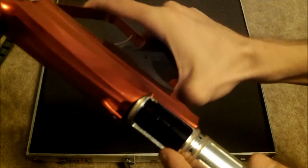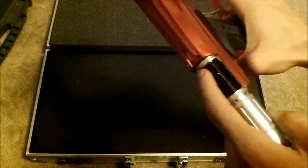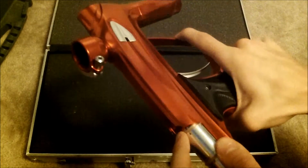So see, just like that, it's pushing up on the O-ring. You don't want to just ram this thing in there because you are going to rip your O-ring, right? So with your finger, just kind of guide each one in. Then once you get to this point here, you want to lift this latch, because if you can see that, there's a little pin there underneath it.